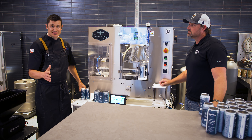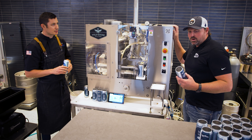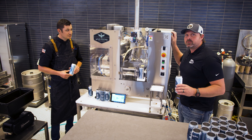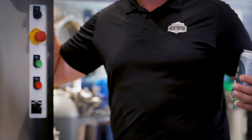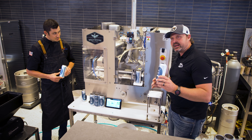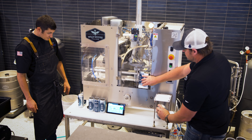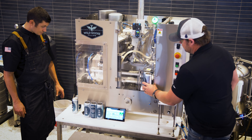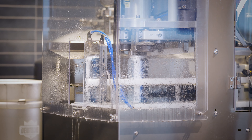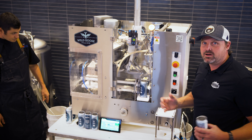We've taken care of the brewing process; now we need to put this beer into some cans. So Brad, how exactly does this Wild Goose canning system work? With Wild Goose canning, you can take your can — be it 16 ounce, 12 ounce, slim cans, any style you prefer — and any beverage you choose, from wine, mead, beer, or water. It'll take the beverage, put it into one of our cans, transfer it down to our seamer, add the top, and kick it out to your side. This system will do about 600 cans an hour, or about two and a half barrels. Wild Goose also does canning lines that go up to about a thousand cans an hour, so whatever your needs are, large to small, Wild Goose has you.